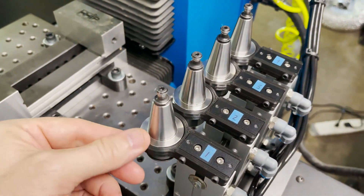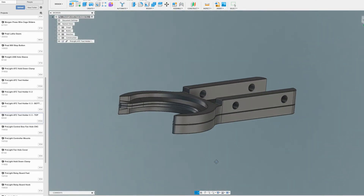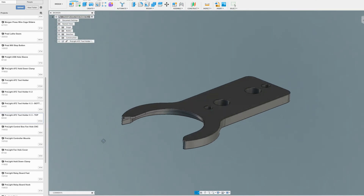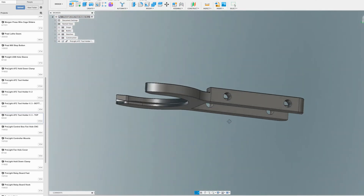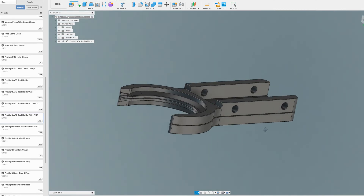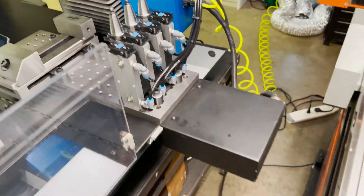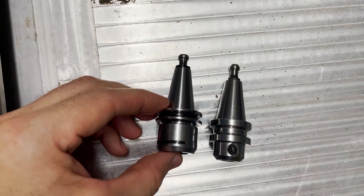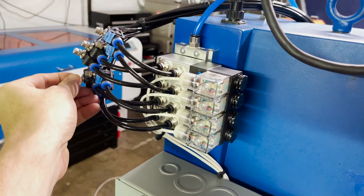Next are the tool holders. I ended up making this out of two separate pieces so that I could 3D print it without support material, giving a much cleaner edge on it. The air cylinders had a number of different mounting holes for M3 screws, so I was able to put some through the bottom and some through the sides. It feels well supported, but it's also got enough flexibility that if it needs to break to save a machine component, it can, which I think is a good feature. The air cylinders would move so fast that it would throw the tool right out of the holder, so that's why I put in these airflow control valves to slow them down.